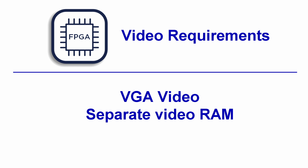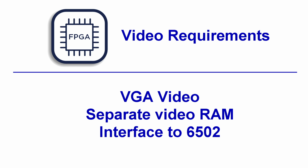Once we had a plan for the board, then we really needed a better long-term video chip solution. So I reached out to the community, to some people who were FPGA experts, to see if they could design a custom video chip. I only had a few requirements. I said I wanted it to output VGA video, and I wanted it to use its own RAM, and I wanted it to interface to the system bus through 4 registers, so it would essentially occupy 4 bytes of system RAM.